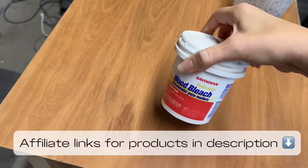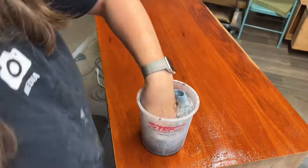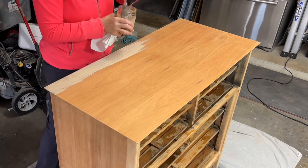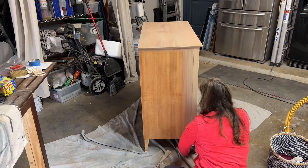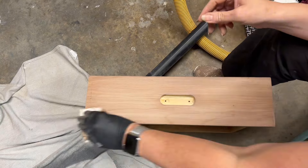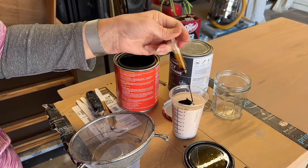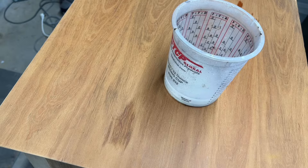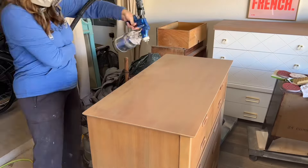I moved on to oxalic acid to see if I could get some of those stains out. I thought it was going to work, but I ended up having to fix it again later. I'm doing a tan wash, adding a little bit of yellow to my tan wash just to cancel out any weird undertones — I was doing a two-to-one ratio of paint to water, applied it with a brush and wiped it back off. I felt it was a little flat, so I decided to tone it with a little bit of light brown dye stain mixed with my top coat to warm it up. I still had a spot on top, so I sprayed it with some shellac and redid the top — that seemed to seal in that stain.